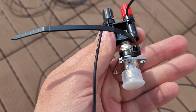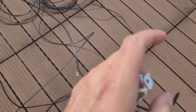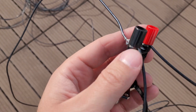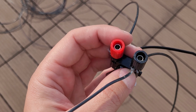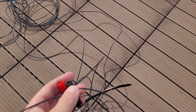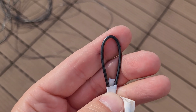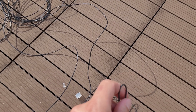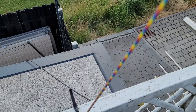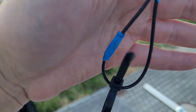Hi, I have built the next antenna and I have made some cool QSOs. It is a ground plane with just two radials in a special configuration. Most people build it in an Überraschungsei, a yellow plastic egg for children with some chocolate around it. CB radio stations in Germany call it a Schweißfuß GP or Schweißfuß ground plane antenna. I have built the antenna for the 20 meter band, and if you want the dimensions just leave a comment below.